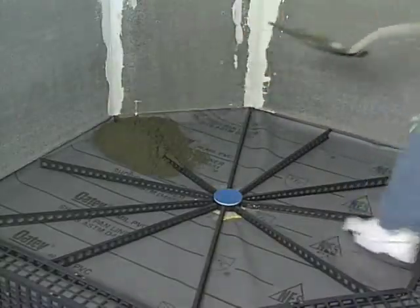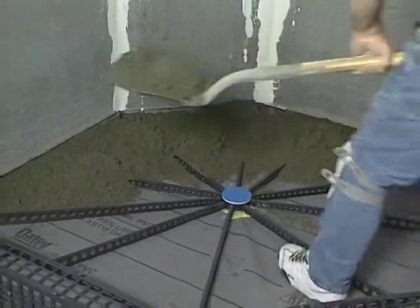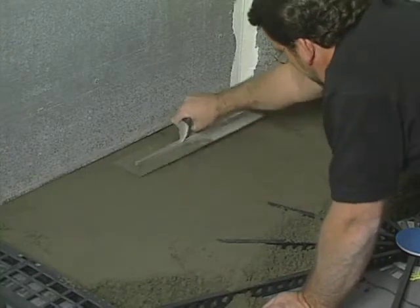Start filling with mud furthest from the exit, screeding to the top of the sticks,